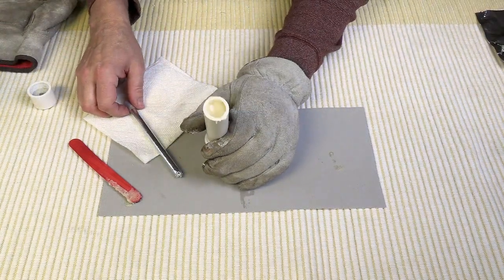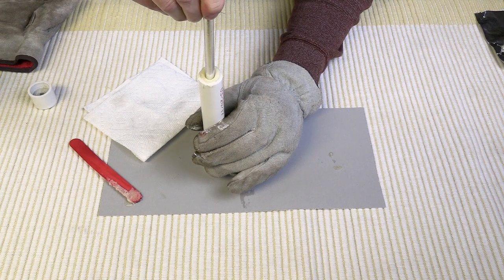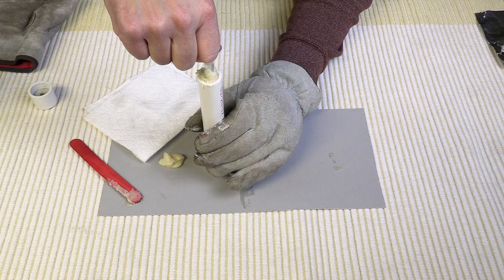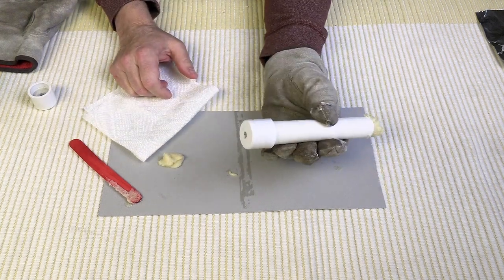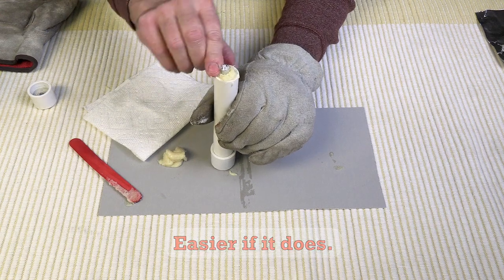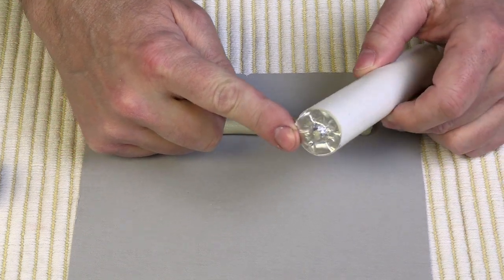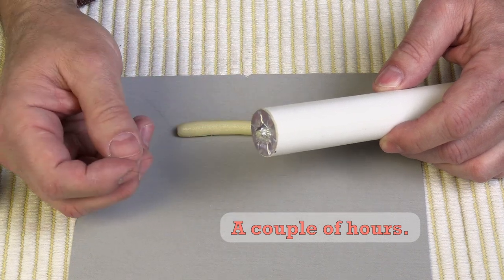What I want to do is push the coring tool down as straight as I can into the core. As you can see, it's oozing out — that's okay. I've hit the center of it. It didn't come out all the way, but it doesn't have to. This is our test piece, and I'll pull the end off with the guide tool. You can see that the quarter-inch aluminum rod has poked right through the end of it, just perfect. We'll let that set until it gets hard, then I'll extract the aluminum core tool and pull the aluminum foil out.